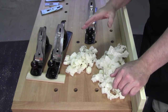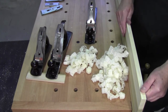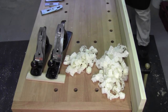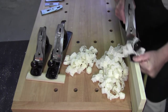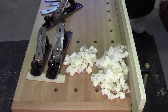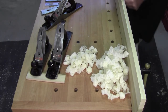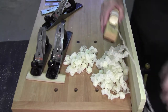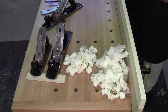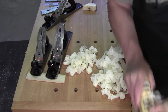Now that's too tight for a friendly wood like this Tulip Poplar. This wood will behave with just about any plane — it'll cut beautifully with just about any plane. In fact, a plane even without a chip breaker, like this little block plane, will work and give you a decent shaving.